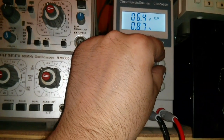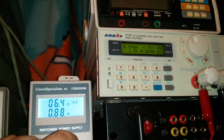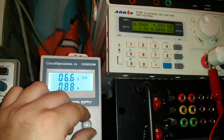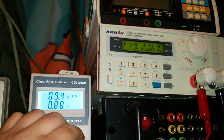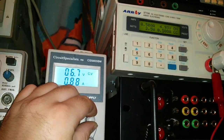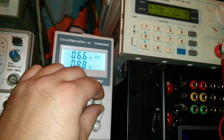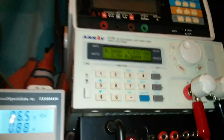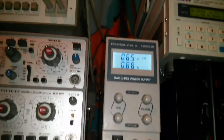7.5 - let's turn it down. Okay, so we can see we're at 6.3 and we've got 4.79 on the out. 6.6 - let's just give it a fine tuning. 6.8, 6.9. What seems to be the limit? 4.93 volts seems to be the limit. So we only need 6.5 volts - somewhere between 6.5 volts input seems to be enough to give this a regulated output, getting 4.93 which is close enough. To get its full regulated output, we only need a 6.5 volt input - so it's only a 1.5 volt drop.